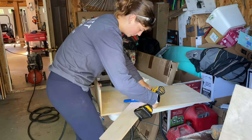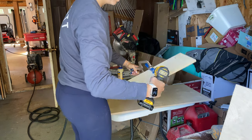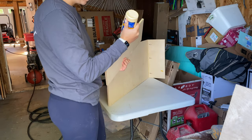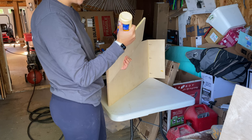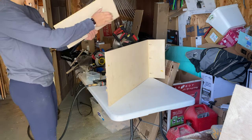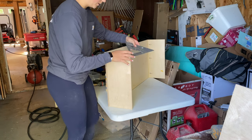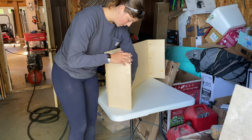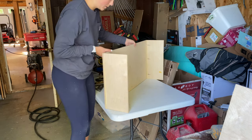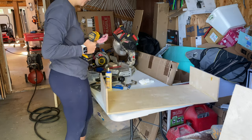After checking that the back piece fits properly over the wheel, it's time to make the small inside box to cover the wheel well. I drilled pocket holes on the two side pieces to screw into the front board. Then I added wood glue and one-inch brad nails to hold the side in place while I screwed one-inch Kreg screws in the pocket holes — that's the screw length recommended for half-inch boards. I placed the pocket holes inward so they won't be visible with the final product.